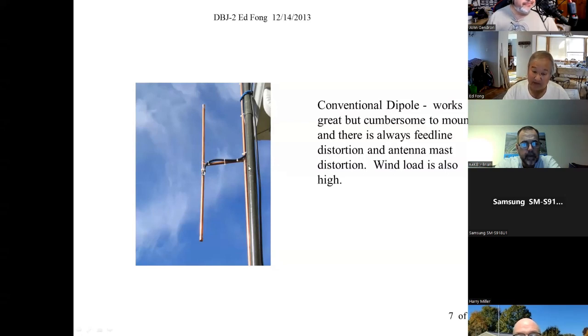We built these. They didn't hold up very well at repeater sites because this solder is very soft, and we noticed these things just fall apart after a while with winds. It eventually rocks off there. It needs to be welded, right? A good antenna like this configuration has to be welded. Solder is just way too soft. The wind will eventually work it out.